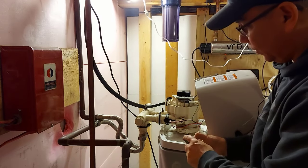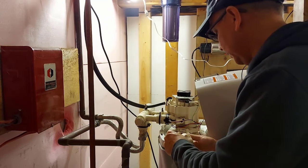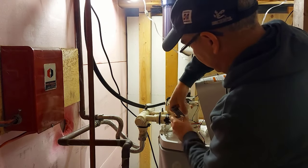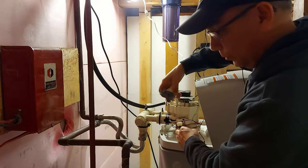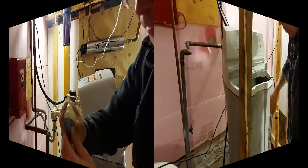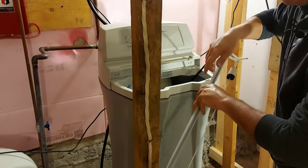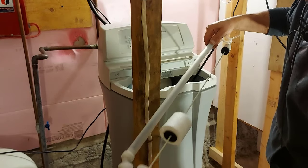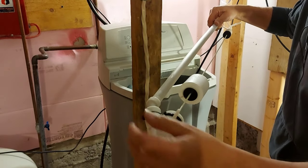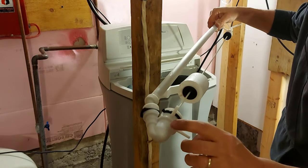This is what it looks like — there are two holes here, so I'm going to check these for blockage. This is the hose that goes to the float tube like I mentioned. I took the whole float mechanism out of the tube and I'm going to take this apart because it could be plugged up in here or under this seat here. I'll take these clips out and check all through here, and if it needs cleaning, it needs cleaning — that very well could be the issue.